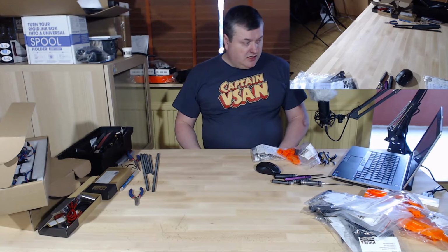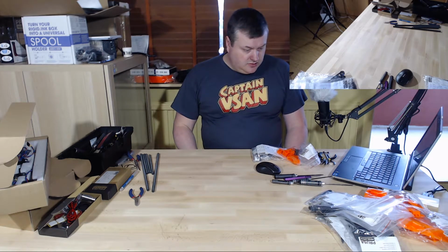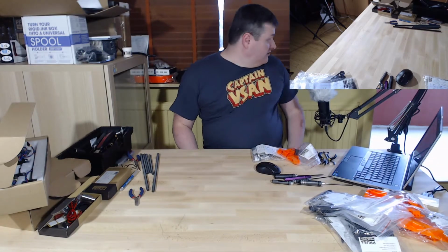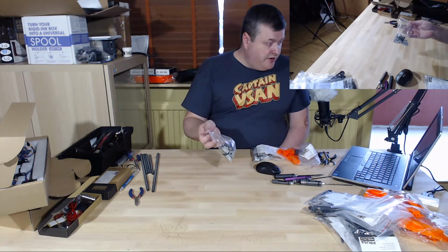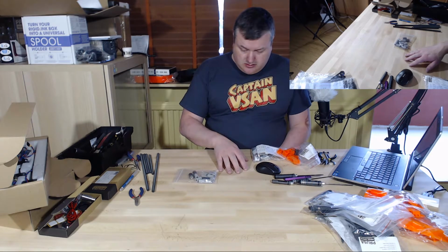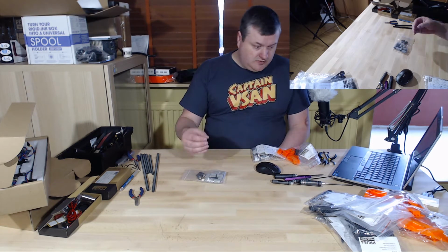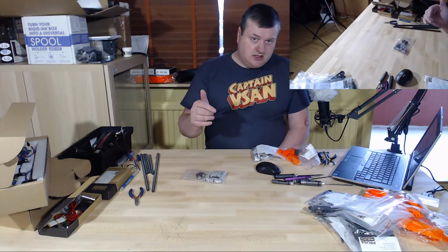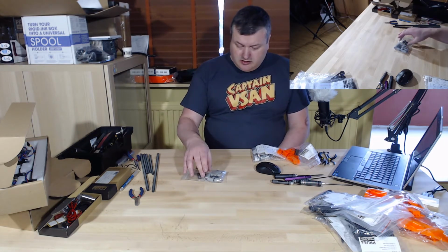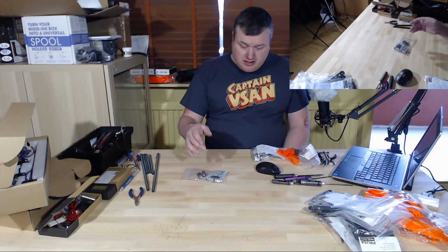So I'm gonna just get started and yeah, I'll talk to you if I find something to be difficult or I want to point out something, or like I have the IGUS bearings I bought. I'm gonna put those in for the Y and X carriage, but I think I'm not gonna do it in the Z axis. I've seen in some forums people talking about the Z carriage with the IGUS bearing binding, so I don't think I'm gonna put them there, and there's less movement there and less noise.